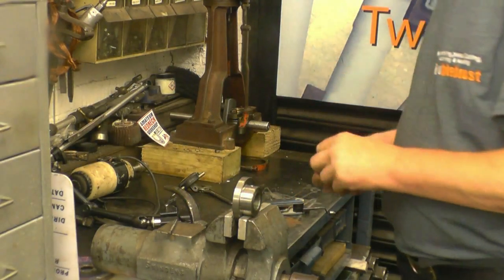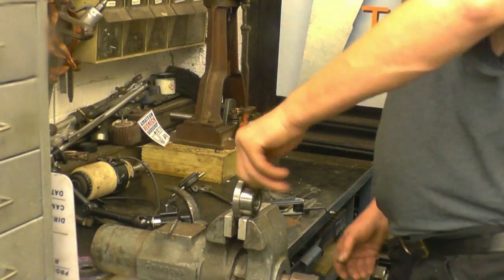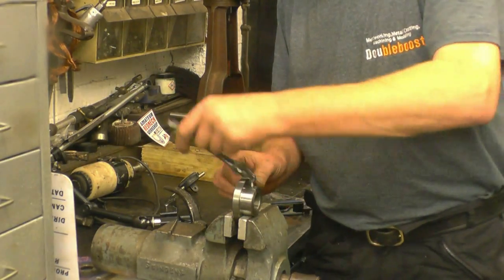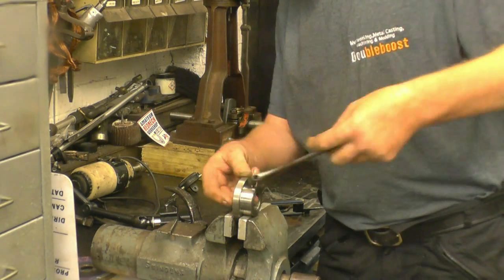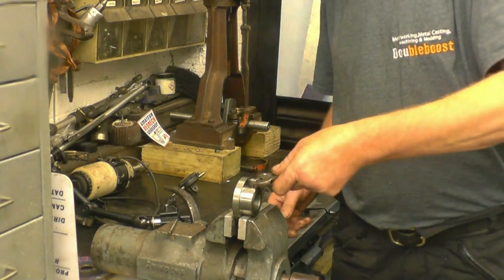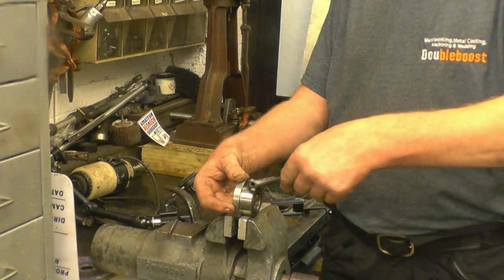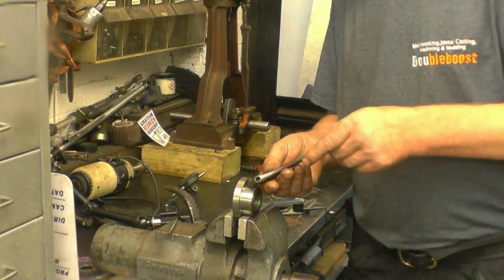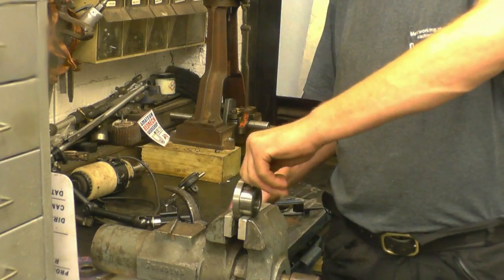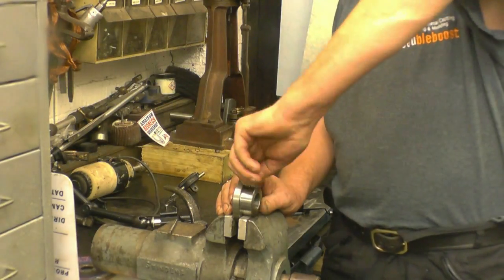Then we'll try the bolt on the wood. Very good. I've looked at quite a few old pictures of similar steam engines to this, and this is the sort of locking bolt they've got under the crankshaft. I think we'll have a little bronze tip on the bolt, it'll stop it from damaging the crank.